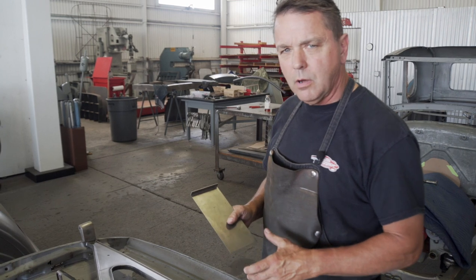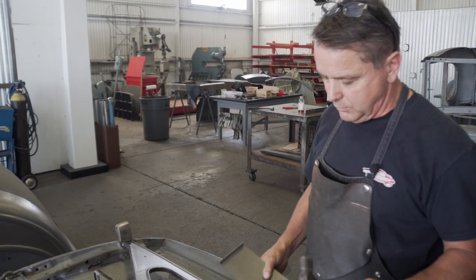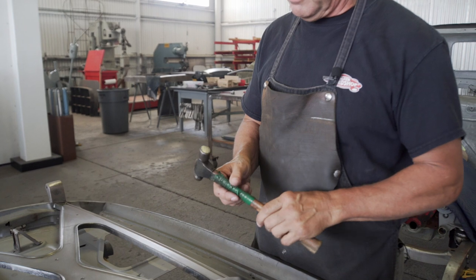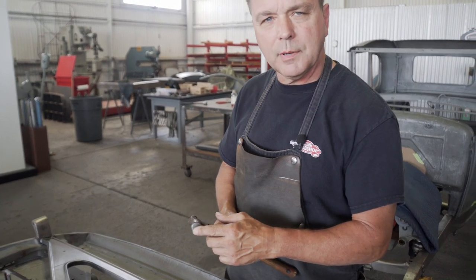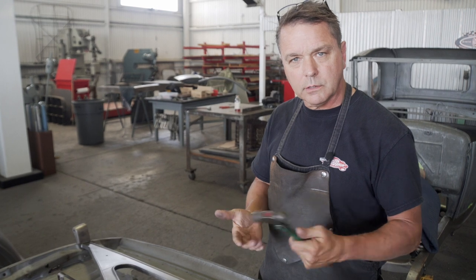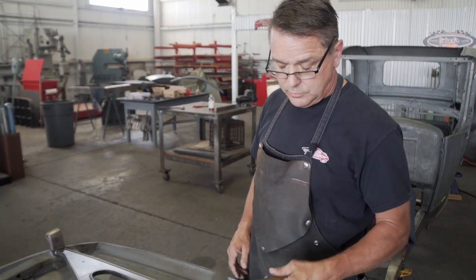We use a lot of equipment in the shop, but I didn't start off with that equipment. I've had this little ball peen hammer longer than any hammer I've ever had. I started using it when I first began TIG welding and doing sheet metal. My heat affected zone — I didn't have very good control with my body hammer; I'd leave marks and overstretch it. But I found that using this little ball peen, it hit just in the area where I'd been welding. Until I really got comfortable and could feel what I was doing from experience, this was the number one hammer I used for planishing welds. It's just a little plum hammer. I've probably had it for close to 40 years. Then I switched to this Martin.